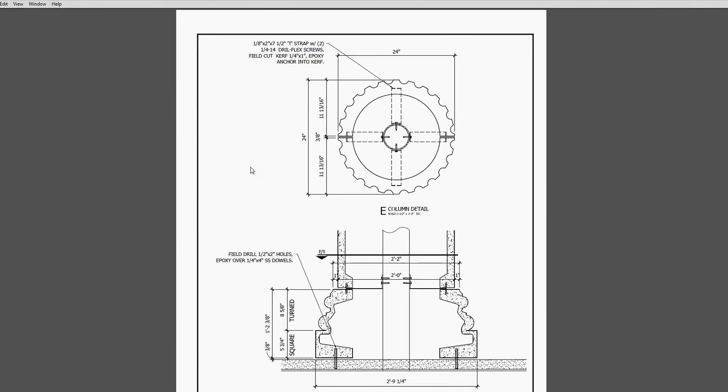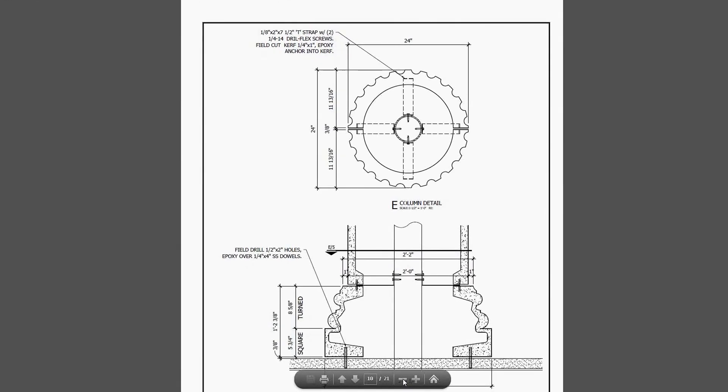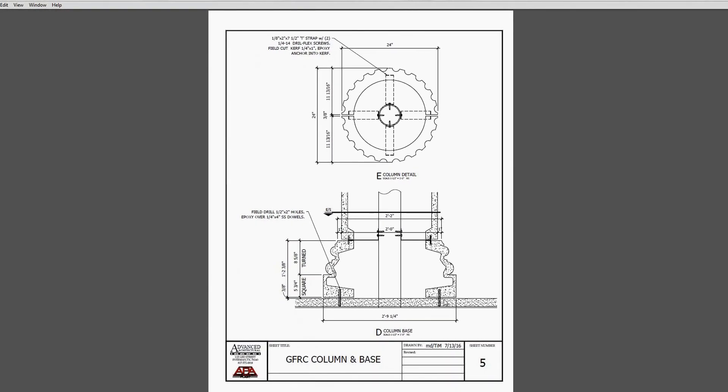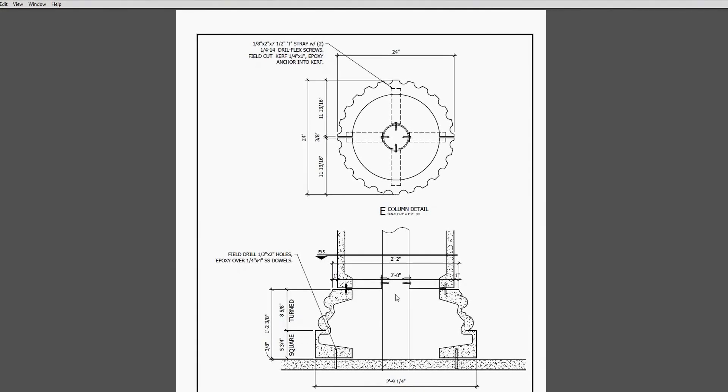This sheet shows a column attachment - the same columns we saw on the first elevation. Here you've got a drilled-in pin that was drilled into the bottom of the GFRC column base, then pinned down into the structure or foundation. This could be done with inserts cast into the bottom and threaded dowels. Here we've got a T-clip bent in both directions: it fastens the column base down and accepts the first half of the GFRC column shaft. These are just surrounds wrapping around the structural support, with no framing in the pieces.